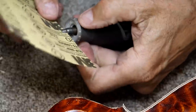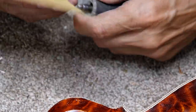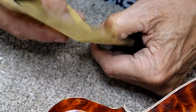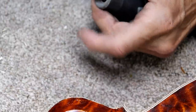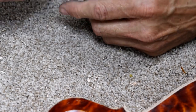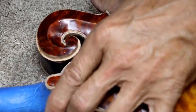And that is, if I can get this sandpaper slid into this collet here and sand it down just a tiny bit more, it's not exactly the best option, but it's about the only option I've got. It might be just enough though, because boy, it was really close to holding it, and just a couple thousandths would probably make all the difference. That might do it. That seems solid. So let's try that now.